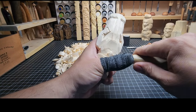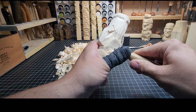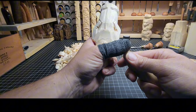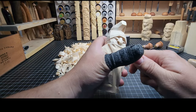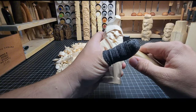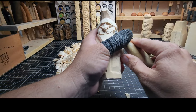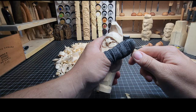Do the same thing on this side, carving out the top line of it, then the bottom line — take your time following that line. Connect it, then cut up to it. Stop cut where you need to to pop those things loose. It's hard to stop cut to a curved line, but you can do it with enough practice. If you can't, just do it close and then stop cut the rest out with straight flat cuts. We've got that bottom edge of the mustache defined, and we can get the top edge between the mustache and the cheek.